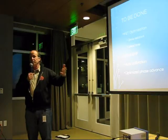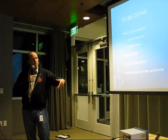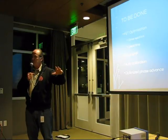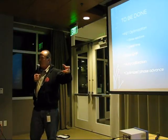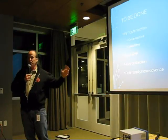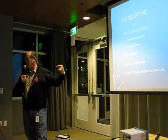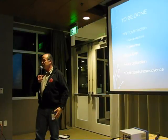And of course, the processor can communicate any way you like. This one has USB built into it. I2C is what we're using. You could use anything you want to communicate with it, including the normal pulse commands that we use for model radios. You just send it one of those pulse commands and close the loop right on that board to position that motor, including with external sensors. Say you've got your motor and your gearbox, but there's a potentiometer measuring the position of your arm someplace else. You can close the loop around that encoder as well. So it really opens up all this new stuff that we could do almost turnkey.